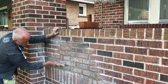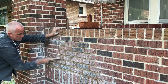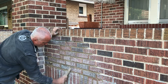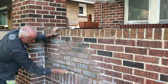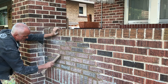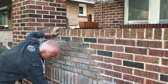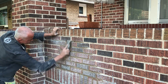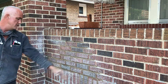Because I'm going to wire brush it, the dark marks don't matter — they'll get brushed out anyway. If that were a finished joint it needed to be struck faster before it hardened, and you'd want to keep that tool wet. You don't want black marks in your mortar. We're just wire brushing it, and then I'm using a nylon bristle brush — all things you can get from Home Depot for five or six bucks. Thanks for watching.